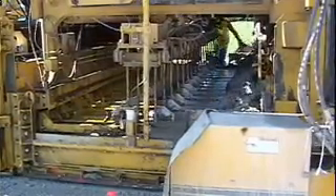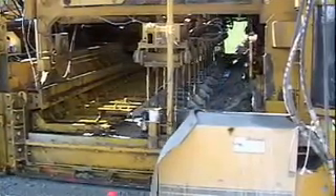Johnny said they get great accuracy with the IDBI. Accuracy has been wonderful. I show the state inspectors right off the bat how we string it and get our depth, and then we'll dig up a couple here and there just to visually check them — they've been great. We actually shoot plastic tubes at the end for our runoff headers, saw it off, epoxy the bars in, and they're almost perfect.